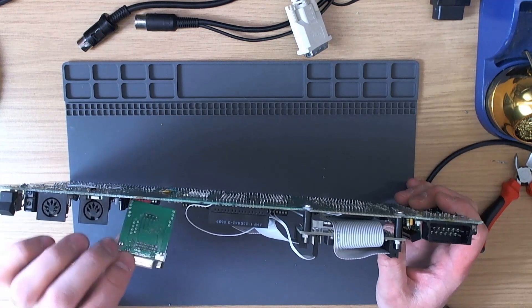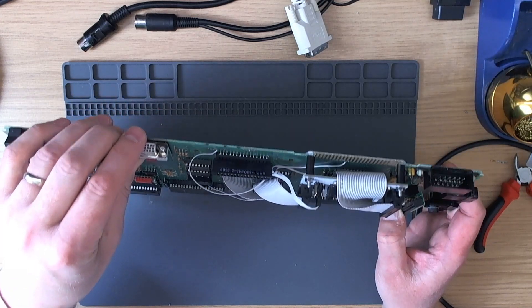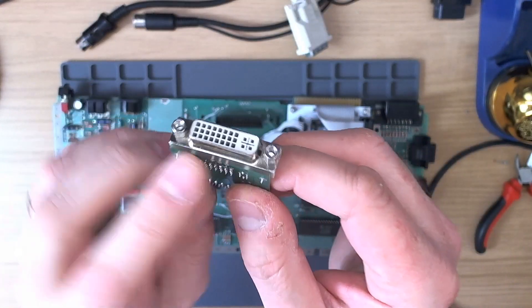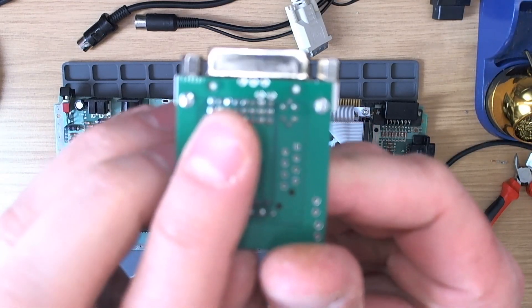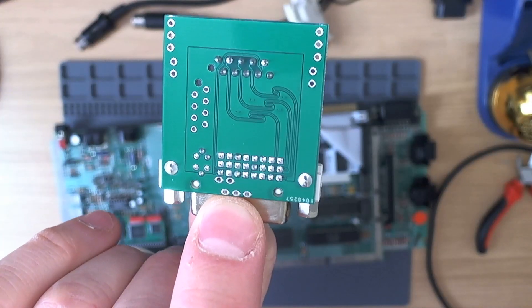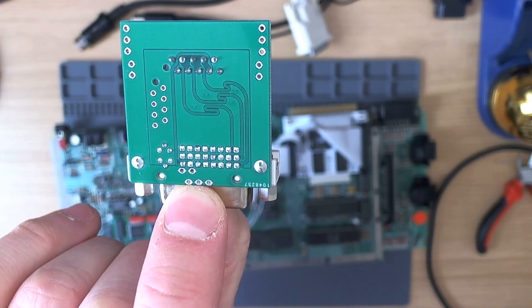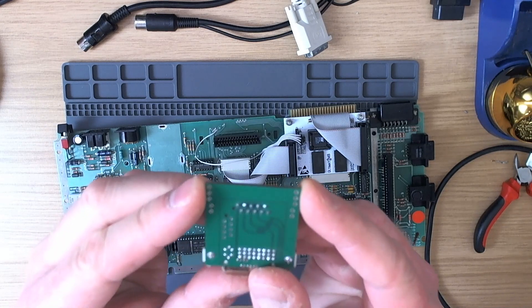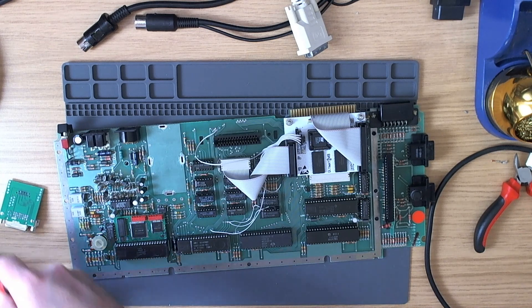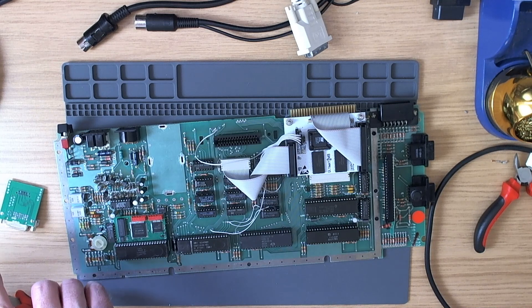We need to figure out which mounting positions are going to work. It's obviously going to be the two at the back, furthest towards the back of the board. I'm going to put two pins in there, and then we've got two rows of little vias at the front. I'm going to populate with pins the two vias at the very edge furthest to the left as you see them on the screen, and the four at the very back. I believe that's going to line up just perfect.